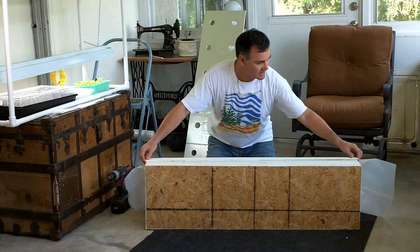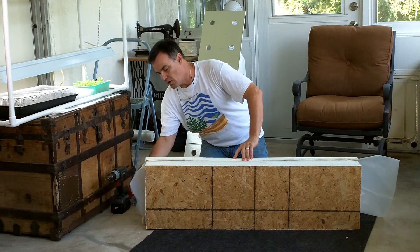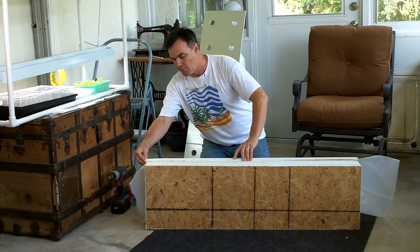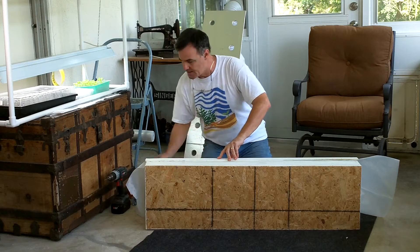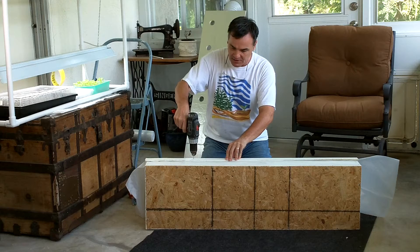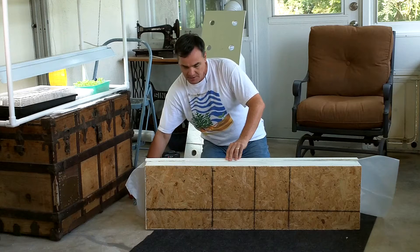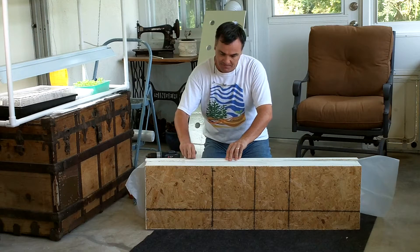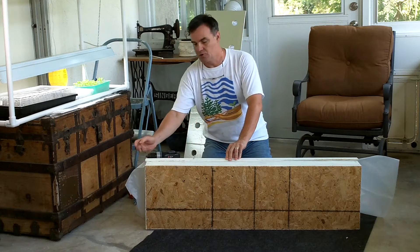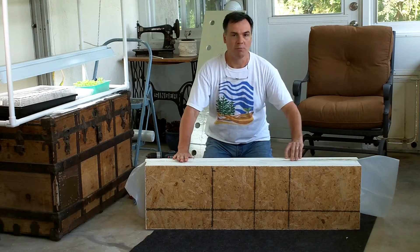With our pieces here, we cut them a little bit longer because we're going to have these end pieces. I just hold this here and make sure I have the first one in line. What you want to do is do your pilot holes — don't go all the way through, just enough to go through your lath. Then we're going to go ahead and screw these in. I've done about six screws on each of the long sides and either two or three on the short sides.